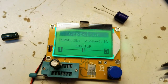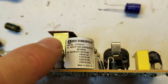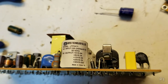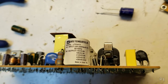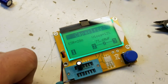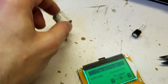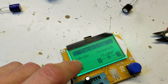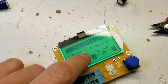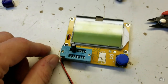The 220 at 35 volts looks okay, and so does the 100 microfarad at 35 volts. Would you look at that - this power supply has a brand, a model, and the voltages listed. So that 2 volts I measured wasn't even right - you've got 5 volts, 9 volts, 12 volts, 25 volts, and 30 volts. This is one of the two capacitors on the hot side - the small capacitor. Big capacitor tested okay, ESR was a little high at 1.9 ohms instead of 1.4, not that bad. But this one is atrocious - 100 microfarad at 16 volts should be 1.6 ohms, not 28 ohms with 12% loss. I believe this loss is just straight up shorted DC loss.